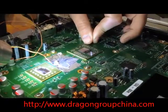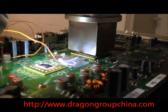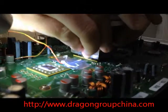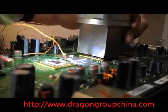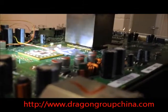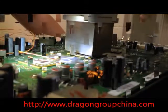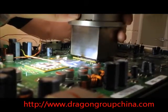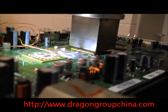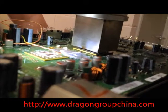Let's use the tops that way. That's it, it's pretty good. You've got the first slope which is just a gentle warm-up on the top here — it doesn't really impact much on the process because at the start of the profile it's just the bottom here to do most of the work. It'll be interesting to see what this board is as well; it's quite an old board if it works. I'm just in the soak stage now, at something about 150 degrees.